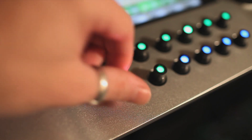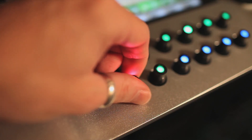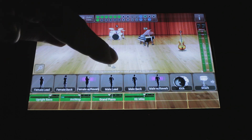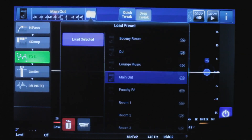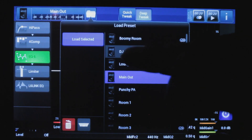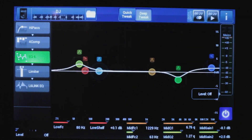On the bottom, we have multi-function encoders which can be faders or parameter control, with the ability to be ganged together in a VCA-style group as faders if you like. It has multiband feedback compression that's easy to use, DSP chains and presets custom-made for almost any kind of instrument you would connect to the mixer. Those presets extend to things you wouldn't expect, like front-of-house room-tuning presets or presets for floor monitors and wedges.